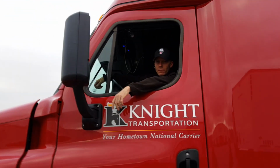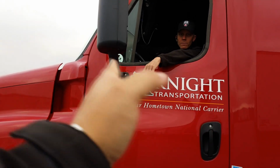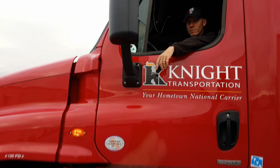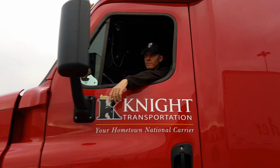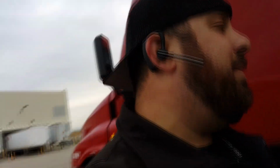So, rule of thumb, if you're not dead on center and you feel it, and you see the trailer sliding a little bit like this, go slow, gentle, finesse. It's all about finesse. There's absolutely no reason to ring the bell. Because why? Because all the crap in the bunk and everything, the coffee, is now all over the place. And it's a mess. Plus, you don't want to damage the equipment. Or break the fifth wheel. Or break the kingpin, for that matter.